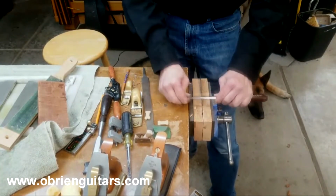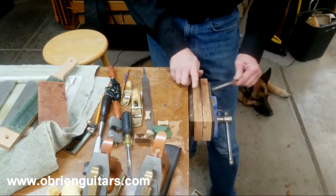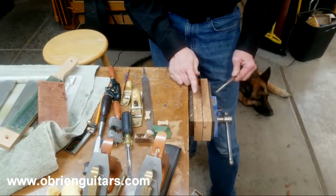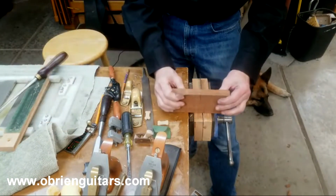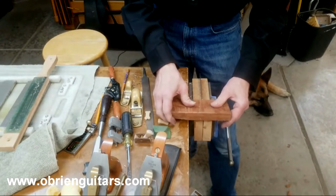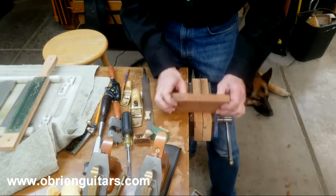And then this is where the rubber meets the road, is to roll that hook over. How far you roll the hook over, how big of an angle, is going to determine how you work with the tool. Let's pretend this is a scraper. If you get that hook rolled over too far, then you're now working with your tool laying down like this, and it's not comfortable. You want to be able to push your tool into the work.